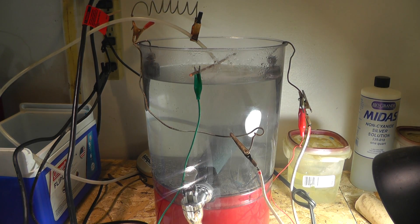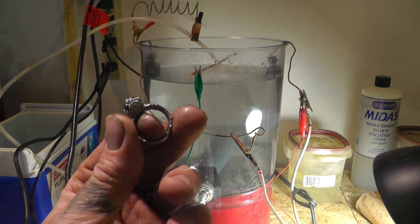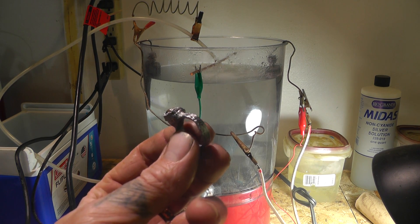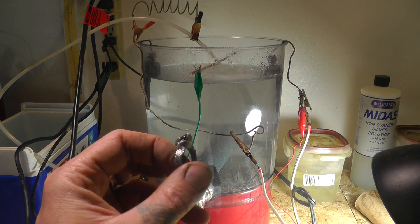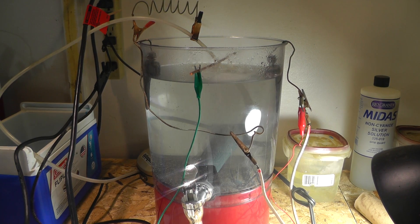No more chemicals like muriatic acid — though it's still handy. If you screw this up and want to take the zinc off, you dip it into muriatic acid and it will immediately strip all the zinc off within seconds. But that's only if you want to remove the zinc. You might also want to play around with electroplating other things on top of zinc, like silver for example. Copper to silver is kind of tricky, but zinc to silver is pretty easy.